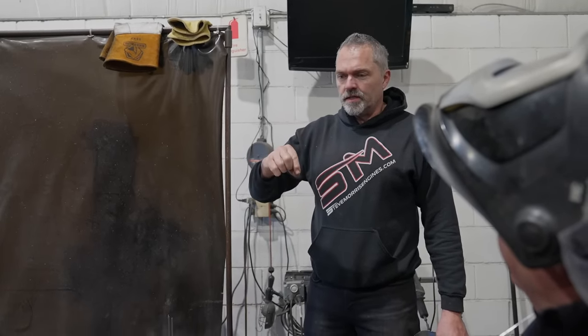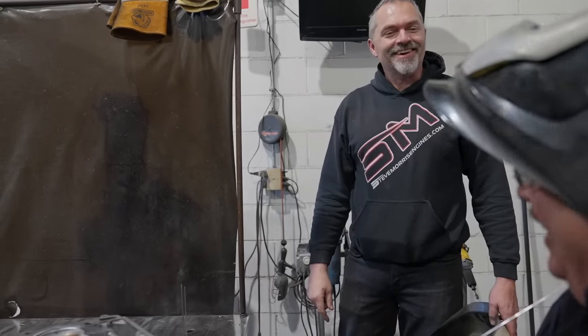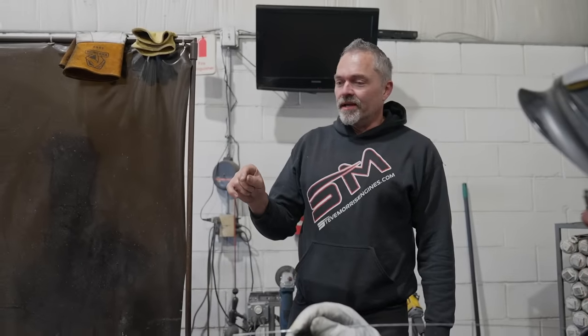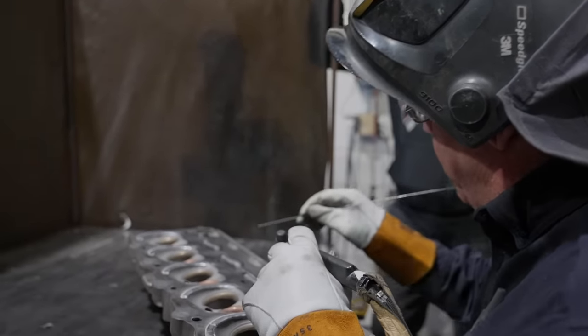And then it keeps it contained. And the shielding gas. I did see you dab it once. Yeah, I did. Anyone says it doesn't, they lie. He holds the tungsten so astronomically close to the part. That's a key. I do not have the hand control yet to do something like that. That's a key, because you want all that amperage to go right to that part as quick as you can.